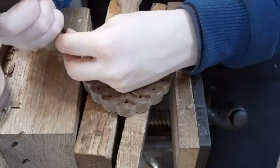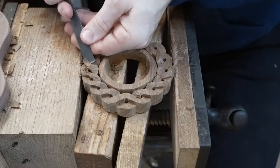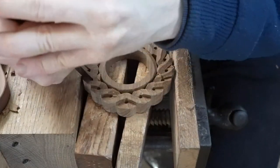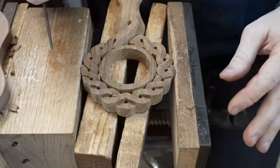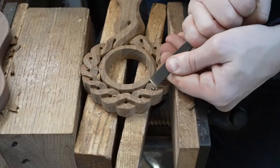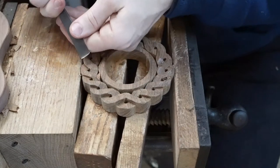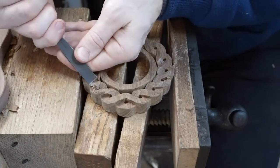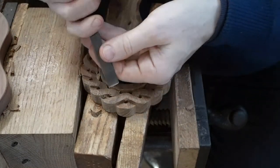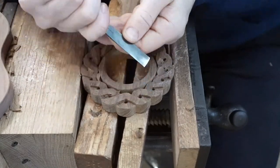The pillar drill and the mortise drill are good ways to drill that hole out because you don't have to worry about lining it up — it's already lined up vertically for you. I've also done it in the past using the scroll saw, and we've got an oscillating sander which is a good way of just finishing it off and getting a nice finish. Just a little bit of wood left over, so we're making that stop cut a little bit deeper and continuing to carve, working our way up to the top.